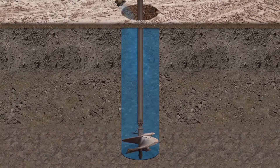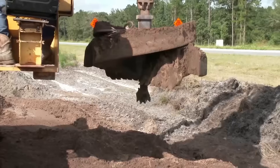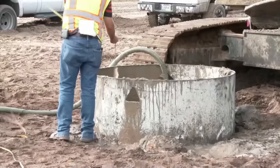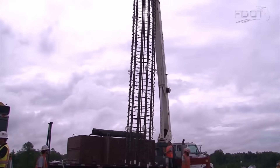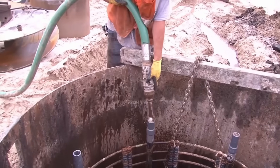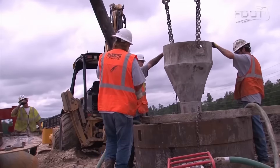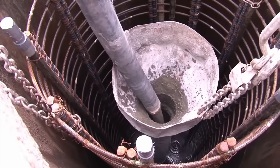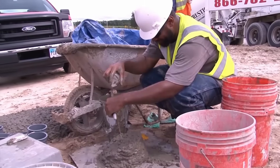Here's an animation showing augering of the soil. And here's a real-life example from Florida DOT showing the installation of a drilled shaft foundation. They're augering the soil and inserting a temporary casing, mixing up a slurry to maintain stability of the excavation, drilling below the slurry, and removing material. Once they reach total depth, they insert the reinforcing cage — you can see the CSL pipes that will be used for subsequent testing. They insert a tremie pipe, attach a concrete pump truck to place concrete into the tremie, and pull the tremie up while maintaining a higher concrete level above the bottom of the tremie. They then use a vibratory hammer to extract the temporary casing.